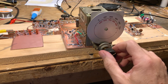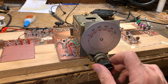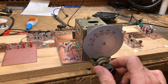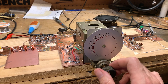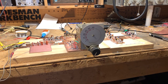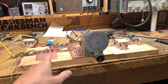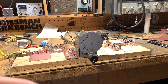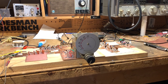All right, there you go — first signals from the Mythbuster. Now I'll build a bandpass filter for 20 meters; that'll complete the receiver side of the project. Then I'll start adding the circuitry for the transmit side. Eventually it'll all go into a box — for now we're quite happy on the pine board, al fresco.